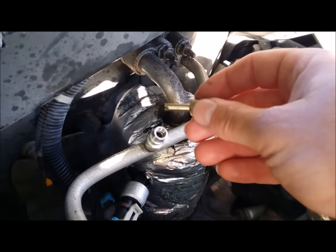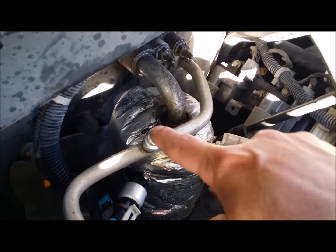All I had to end up doing was taking the Schrader valve tool. In that previous clip I released the pressure on the Freon, and then I turned around and just tightened that Schrader valve back up pretty good. I didn't even have to replace it — it just was a little bit loose. I put my finger over it and I'm not getting any pressure release. Four bucks, fix the problem.